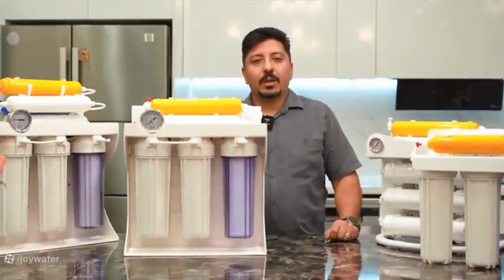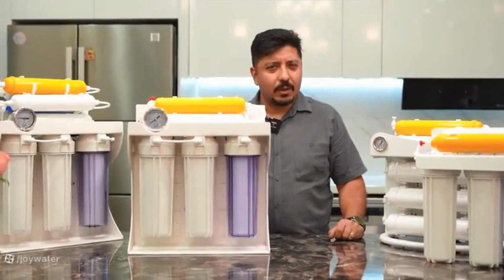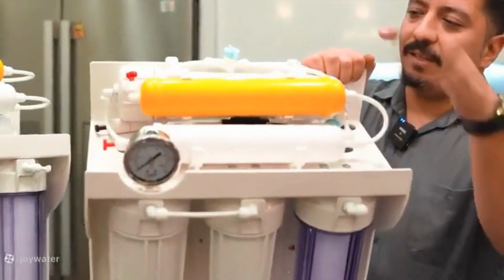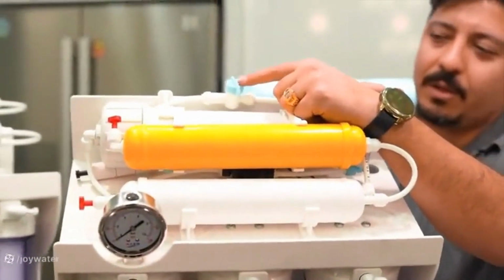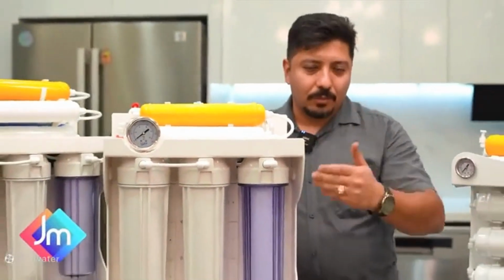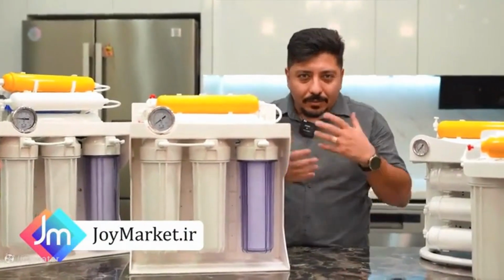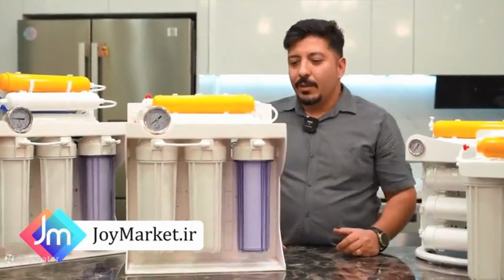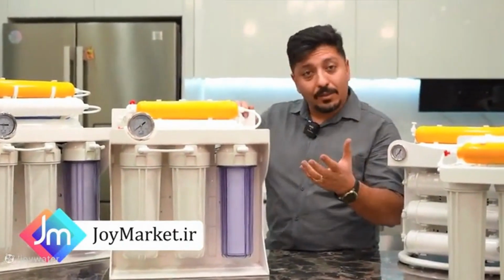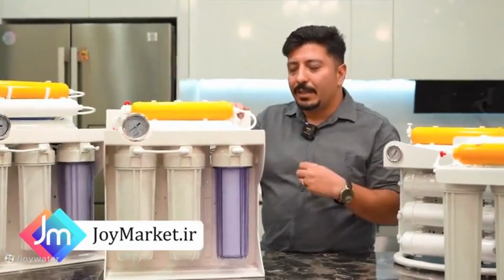Well, congratulations, your device is set up, but the water is a bit bitter. Why? Come with me for a moment. On your device, there is a valve that we colloquially call the mixer valve. What does this valve do? Before using the water purifier, you were using untreated water or mineral water, and your taste was accustomed to that water. Now you are drinking relatively pure water, at least 93 to 95% purer than the previous water. So it's natural to feel that the water is a bit bitter.